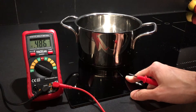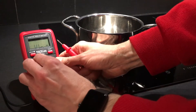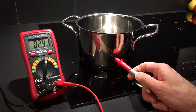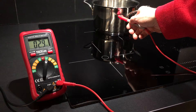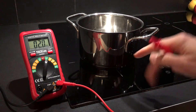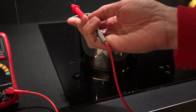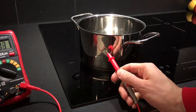So that's pretty interesting. There seems to be some kind of alternating magnetic field still active in this thing, even though it's powered off. We can also see what the frequency is — currently it's measuring kilohertz. When I touch this, I get continually around 3 kilohertz. I guess it's not very accurate, but on the other plate we get the same, around 3 kilohertz.